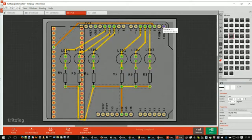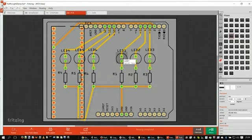And what would be really cool about this is that when I build this board, I could put pins on it from the other side and then lay it right on top of the Arduino, and those pins would drop right into the connectors of the other pins. And that's where they get the term shield for Arduino shields. They're basically boards that you can plug in on top of the Arduino board to make it do other things.